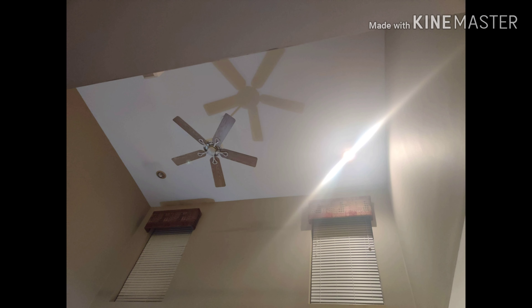With that, you see the Romex is out. Continuing to take the can light out, once it's out I'm uncoupling the bulb using those elbows connected to the can and cutting through the two wires, then dropping it down — it's a 20-foot drop so I asked my wife to place something soft at the bottom. It dropped onto the sofa. This picture shows how the can lights were placed initially. I want to install six lights, so I need to drill a hole in between the existing two lights.